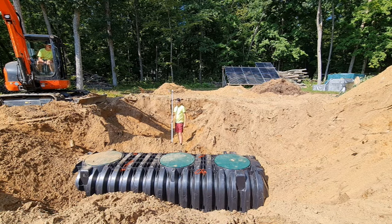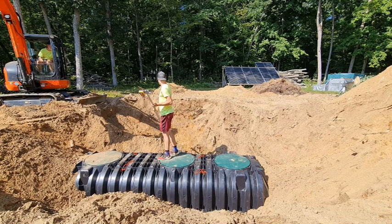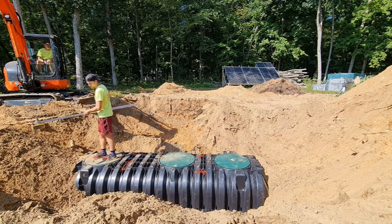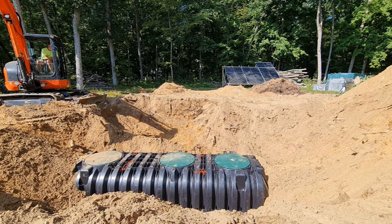You'd think figuring out the elevation would be an easy thing. Sometimes we have so many things going on in our heads that we find it difficult to communicate. We went around for a little bit trying to figure out the elevation because we wanted to respect the elevation of the surrounding soil and make sure we didn't have too much fill going over the top of our field. We had to get at least below the outlet of the septic tank, and we finally came up with a solution.